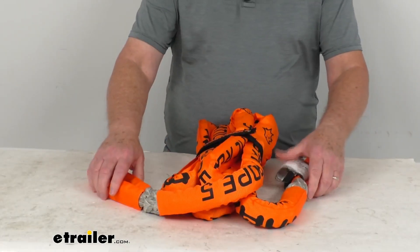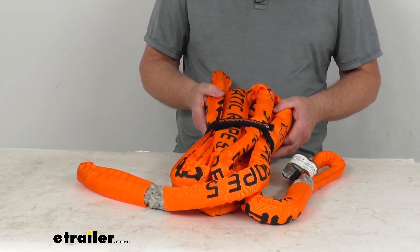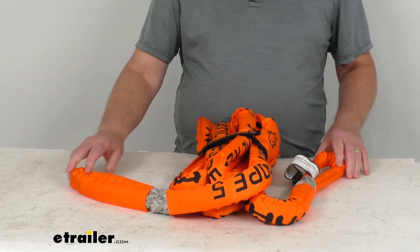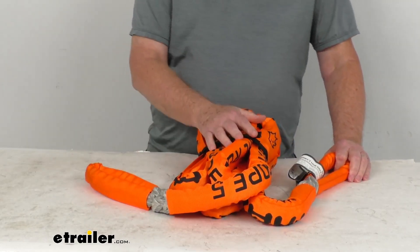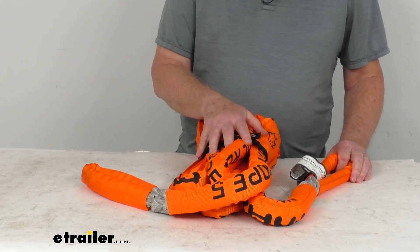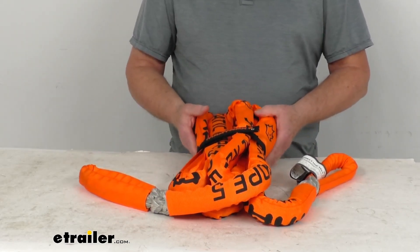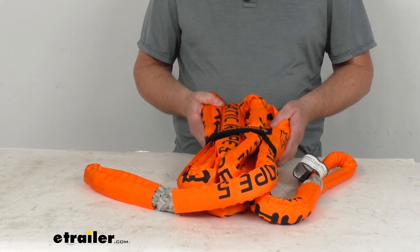This is a high strength HMPE, which stands for high modulus polyethylene rope. It will act as a static element during vehicle recovery, so it is perfect for use with cars, trucks, jeeps, and buggies. The HMPE rope has an extremely low density and a strength to weight ratio that is eight times higher than high strength steel. Also, a nice feature is that this HMPE rope will float where a steel wire sinks.